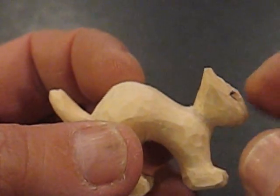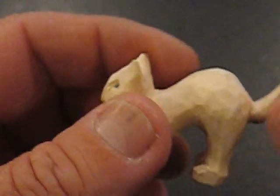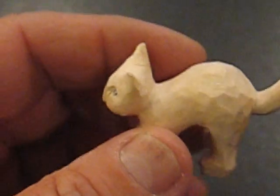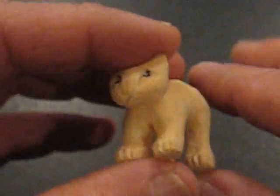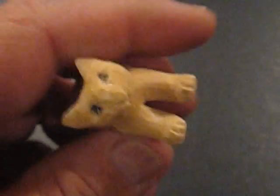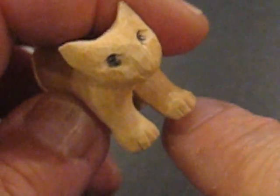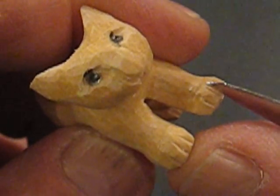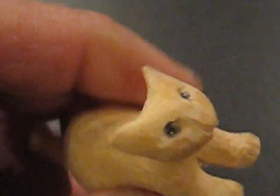So what I did was I took the knife and I cut this out and this out. Put a stop cut and cut it this way, up this way on either side. And then cut it so that mouth is underneath because usually they have a little bit of a mouth underneath. The cat itself, I didn't do anything to the ears. If you take a look at the little claws here, all I did was a little V cut, just tilted the knife a little bit and just cut one side and then the other.